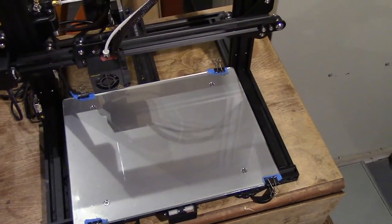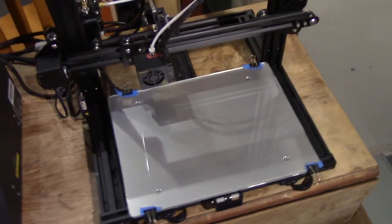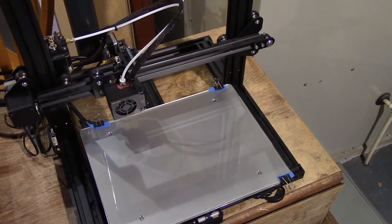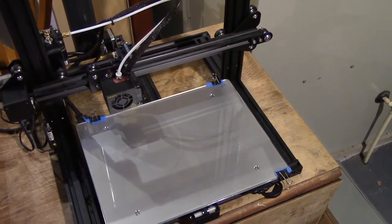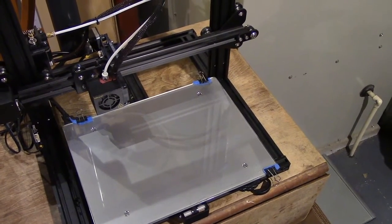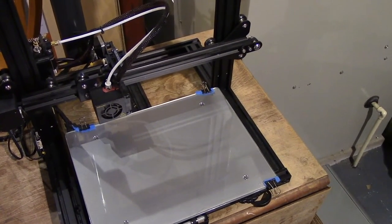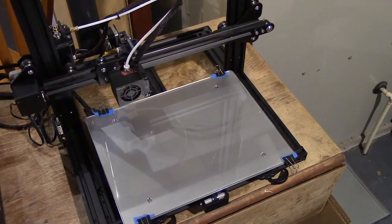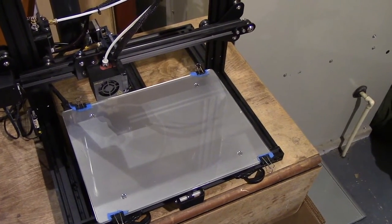The other thing this kit is going to allow me to do is, I mentioned those hardened steel tips on that. That's going to allow me to print materials like nylon. Glass-filled nylon, which is what a lot of stuff is made out of. In fact, you look at most modern handguns. I think Glock popularized it, but even before that, that's a glass-filled nylon. So it's a really rugged material. It holds up well to temperatures. It's not something that's going to break as easily on you. So for a lot of the stuff I want to do, where I'm wanting to print outdoor gear, glass-filled nylon is going to be a way better material for me.